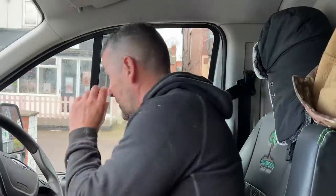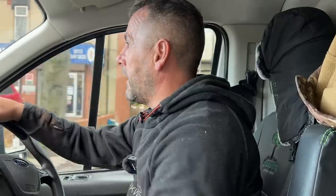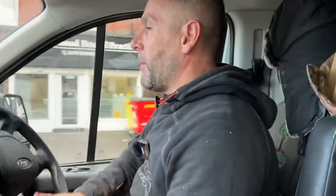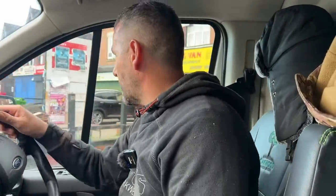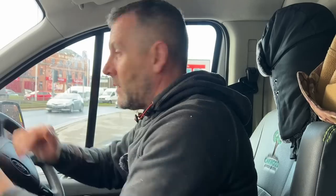RC Esky asks: are nails for the nail gun the same for Paslode and Milwaukee? Yes. There's a slight angle variation on some but all the nails we use are universal - they'll go in either the Paslode or the Milwaukee. For second fix we use 18 gauge - we'll explain that when we do the cedar cladding.